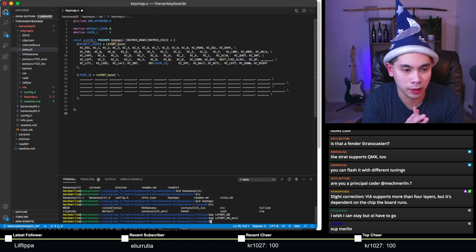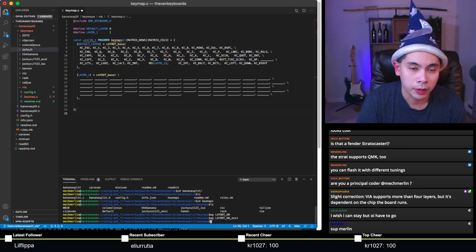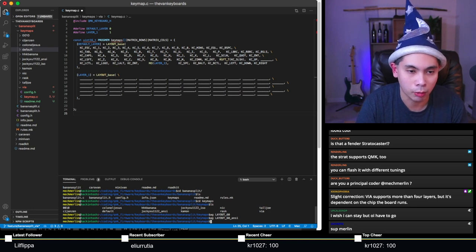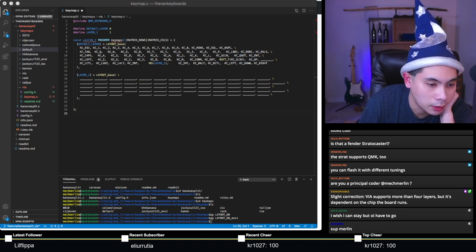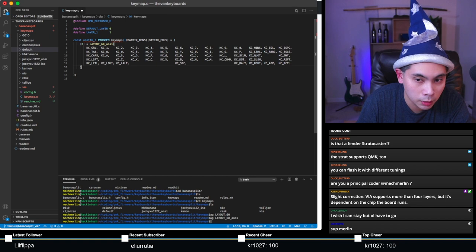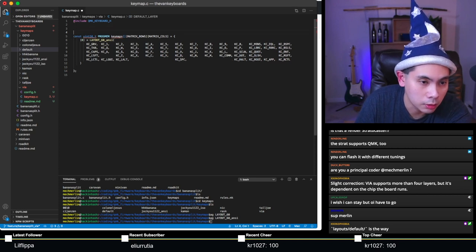Okay, I'm going to cheat a little bit here. Since this doesn't have any keymap that uses the layout 60 ANSI macro, which is the standard layout, with the 6.25U spacebar flanked by 1.25U mods, we are going to go over to QMK and see if I can steal a keymap. Come here, little keymap. Where you at? Give me a 60 keymap. Ah, there. That should be sufficient. Found one right there. There we go. That's a good one. And then I can get rid of these pound defines. No need to do that. Perfect.